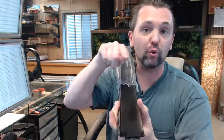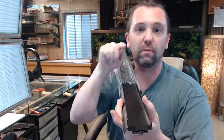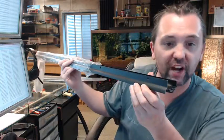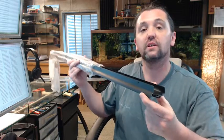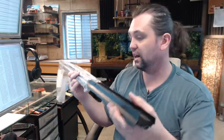It is also nice to have that because as you are pre-drilling the hole for the screws, the drill bit has a tendency to walk a little bit before it pierces through if you have not used a center punch — steel, aluminum, wood, whatever the case is. So having those slotted holes from the factory are really nice. It is a nice feature to help you tailor that to the sill. The frame may not be plumb, the door may not be exactly level, things of that nature.